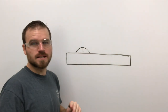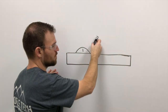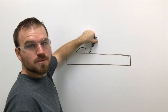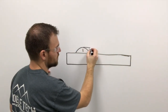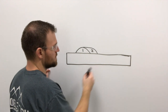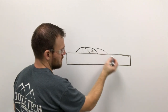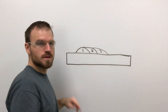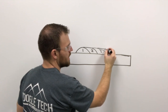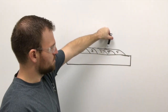I want five to six beads in a row going down a plate. Bead number two goes right here — the goal is that it will cut 50% overlap over bead number one. Then bead number three goes right here. Bead number four we just keep building, and bead number five — all I'm doing is welding at the toe of the previous bead to get where I want.